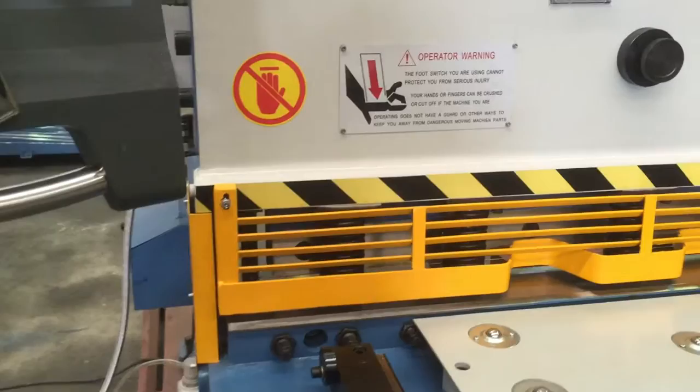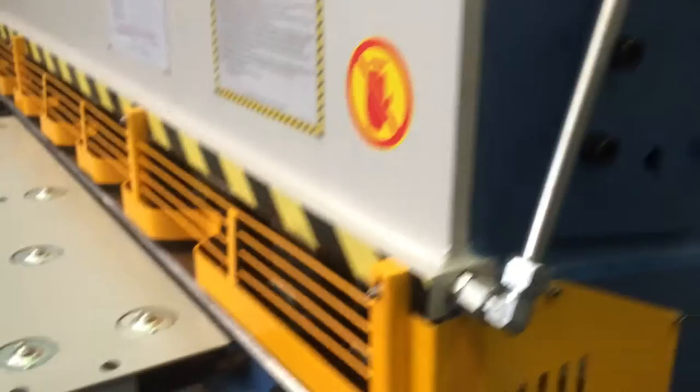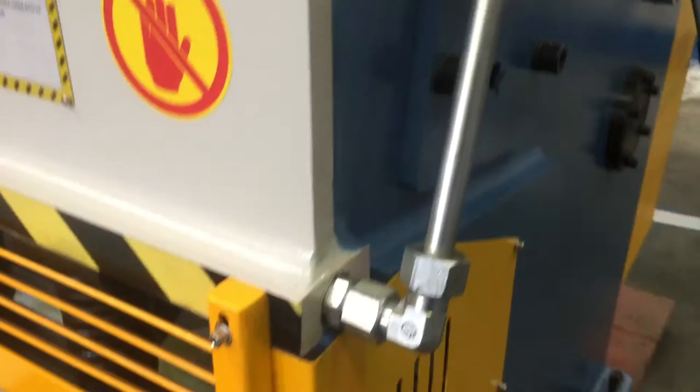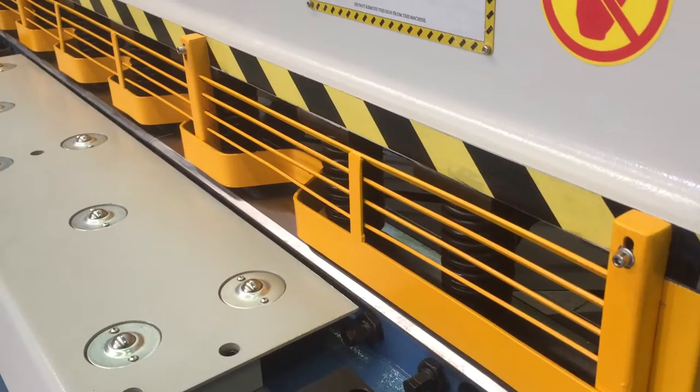Running around the machine now — this is a maintenance shutoff valve here, so if you've ever been doing some maintenance on your machines on the front clamping cylinders, we can basically isolate and cut that off. That's plumbed all the way through here, so this guillotine has individual clamping jacks which gives you consistent clamping all the way along. You wouldn't buy a six-metre machine unless it had individual clamping jacks, otherwise you could have pulling problems with the sheet pulling in.